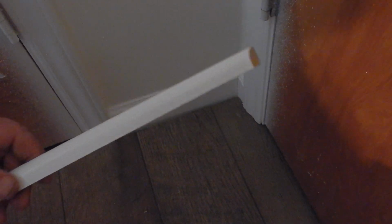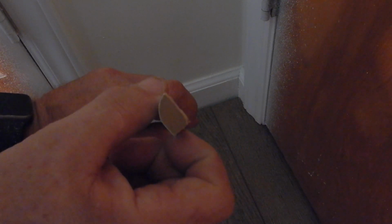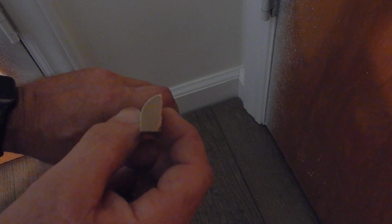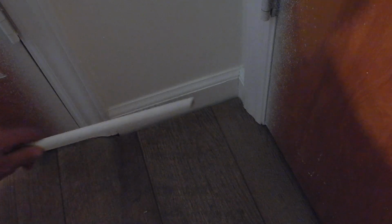what kind of trim we're going to be using. We have shoe molding, and shoe molding is very much like quarter round, except it is narrower this way than it is tall. All right, and we always want to install this with the narrow edge down on the floor. Well, what that means is that we have to pay attention when we're putting our flooring in to have a small gap here. We can't be sloppy with our cuts. Otherwise, we will end up having a gap between where the edge of the shoe molding is and the flooring.